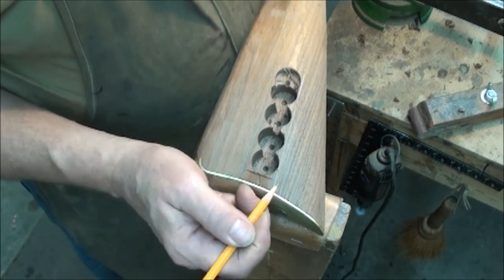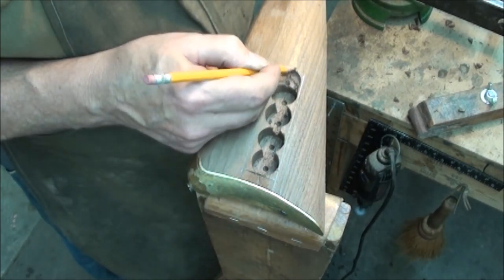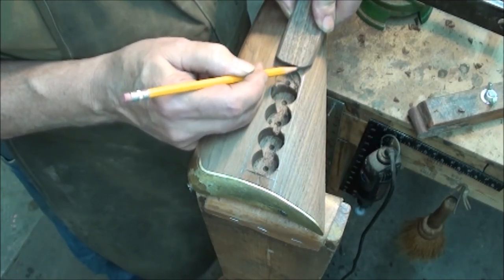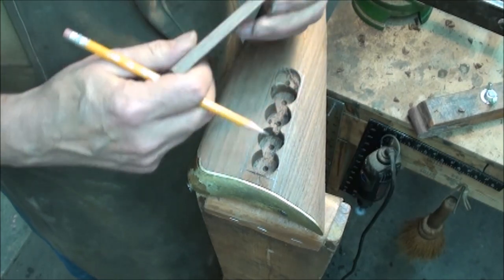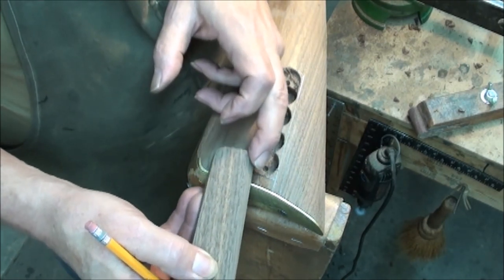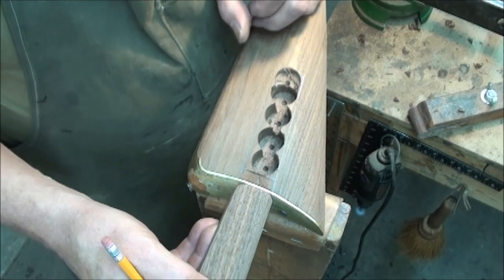And most of these cavities were done with squared corners. So all this will be squared up. This end I'll round off sort of to match the rounded edge on this. Flat in the center, but rounded on the edges. And that's the reason I do that, is because when this is put in place and you slide it in the dovetail, the slight bevel here around the corners will help guide it in easier than very square, sharp corners.